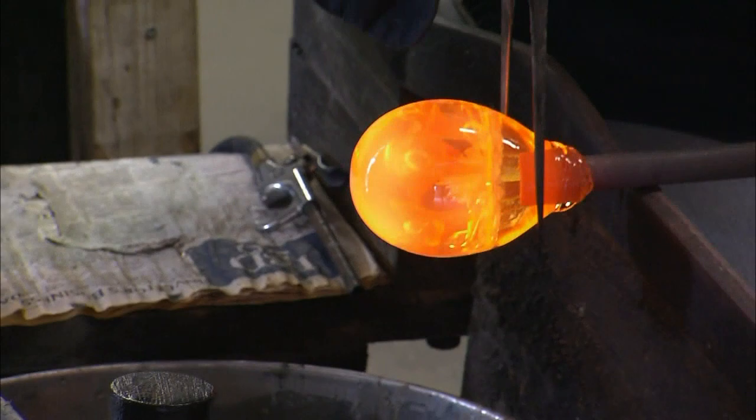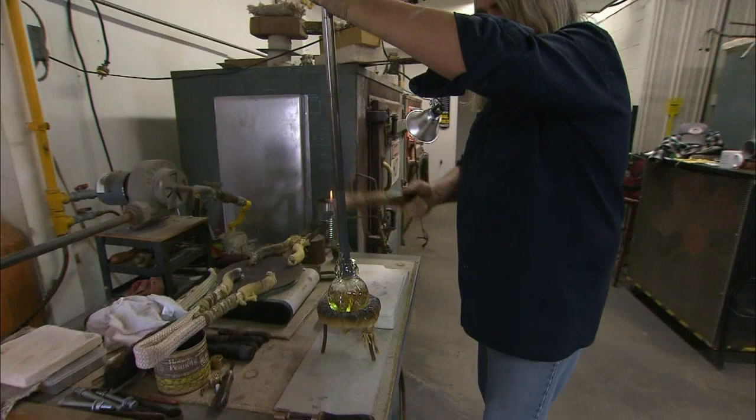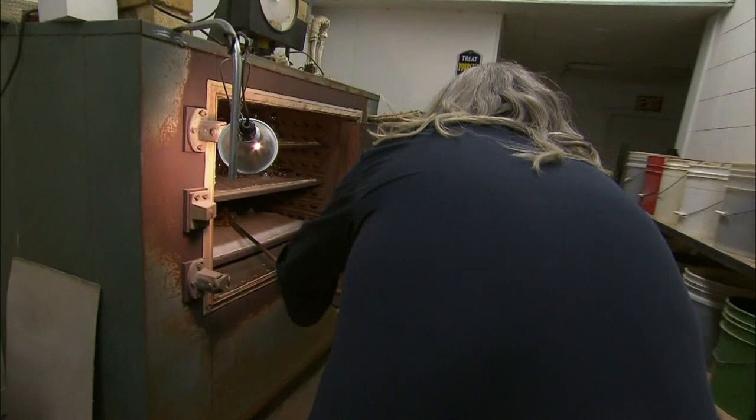In the small facility we have, we can make about 60 pieces of glass a day. The difficulty is allowing the glass to do what it wants to do. When it's ready, it's knocked off and goes to the annealing oven where it sits for two to three days to cool down slowly. We just leave the door closed, wait until it gets down to about room temperature, and take it out.